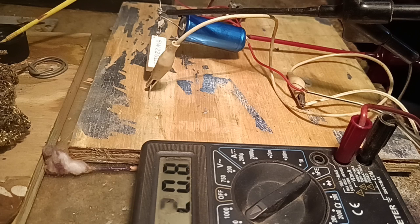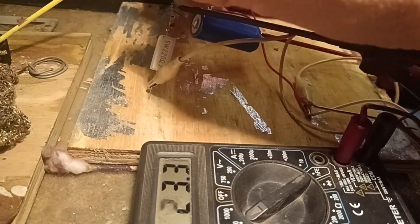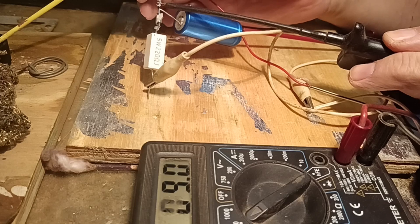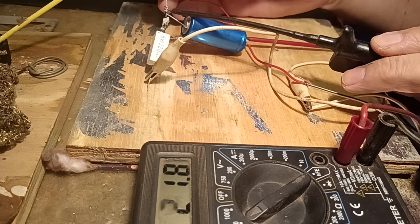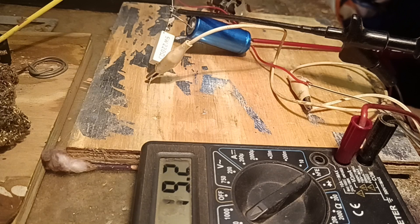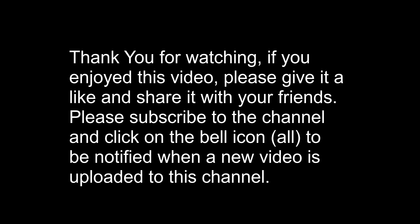The power supply's connection was not great, but now we're at 22.3, 22.4, 22.5 — may even go up to 23 volts — there we are, 23.2 volts. Then if we touch the switch machine to the contacts, you can see it drops down to about 11 volts and then it starts building up, recharging the capacitor until it has reached full charge again. Touching the switch machine again and you can see the voltage drop and climb back up. That sudden burst of energy is enough to power quite a few switch machines simultaneously. Thank you for watching — if you enjoyed this video please give it a like, share it with your friends, and subscribe to the channel and click the bell.